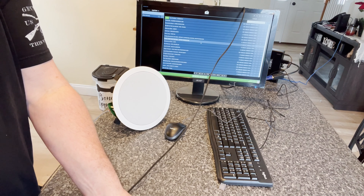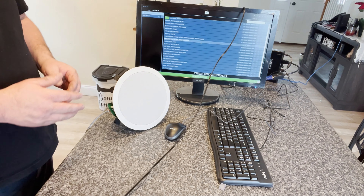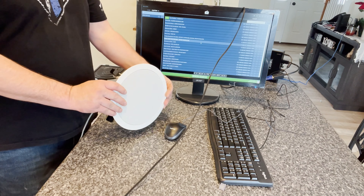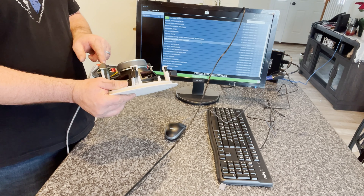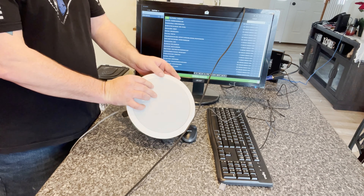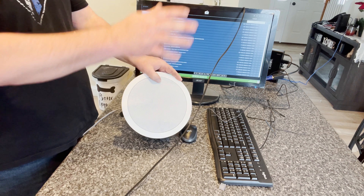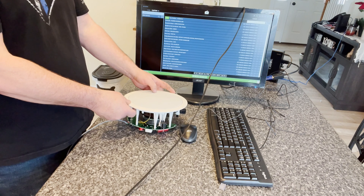That's how it works. You can definitely do it yourself — you can install sound in your restaurant. This video covers the player; speaker installation would be another topic. You can daisy chain these speakers together with an amp — red and black from one speaker can go to red and black on another speaker, if it's easier than running wire all the way back to the amp. There is also another speaker output on the amp that you could daisy chain to a second speaker. Hopefully you enjoyed the video — we'll see you in the field.